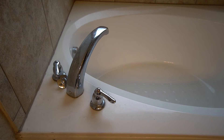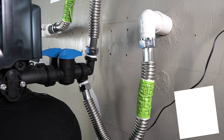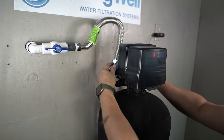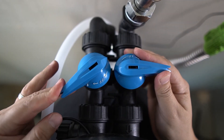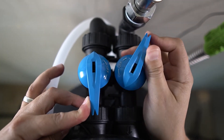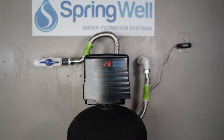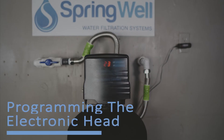The cold water you opened will now begin flowing to the tub or shower. Work your way down through all the connections inspecting them for any leaks. If no leaks are detected, you can turn off the bypass and allow water to begin flowing through the tank. Allow the cold water to continue to run through your system for at least 10 minutes. At this point, your system is now fully operational.